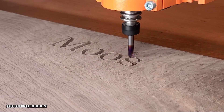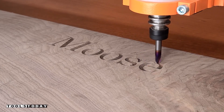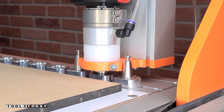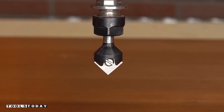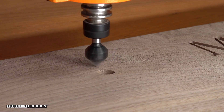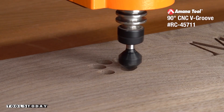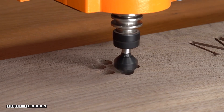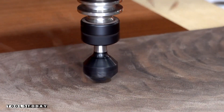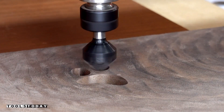With this one, I had a lot of small areas, so I wanted to have a deeper carve, so I'm using a 60-degree bit. For the larger areas, we're going to carve in some paws using the RC-45711 90-degree V insert bit. For these areas I don't have a ton of detail, so I don't need to carve quite as deep. This is going to save the amount of epoxy I need to use and also give me a shallower carve while getting the same detail. It did a really nice job cutting through the walnut.